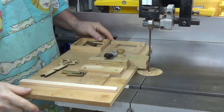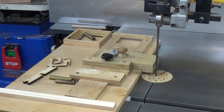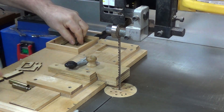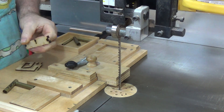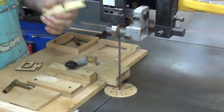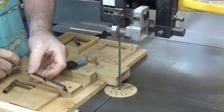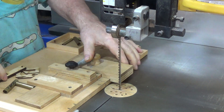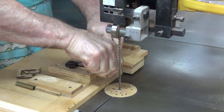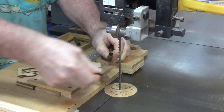Now the way this jig works — let me bring the camera up a little bit closer. You take a blank, and normally what I tend to do is allow a quarter of an inch tolerance for blowouts when you drill the blank, or for shaping or trimming. It depends on what you like, but you decide what you want. I use a 6mm MDF spacer, or you can use a 3mm MDF spacer. The way it works is you pull this slider back, put your pen blank in there, and put your spacer in. Push it up and that's it.